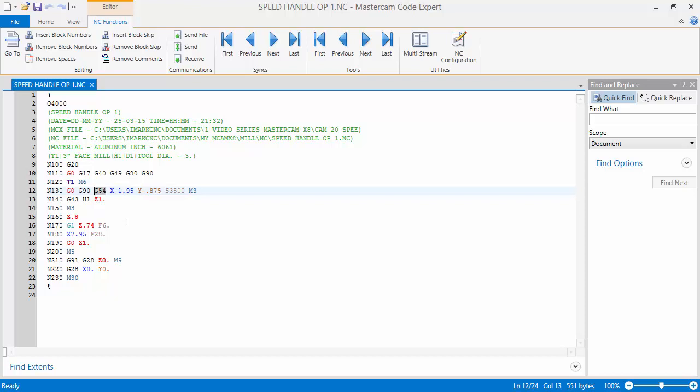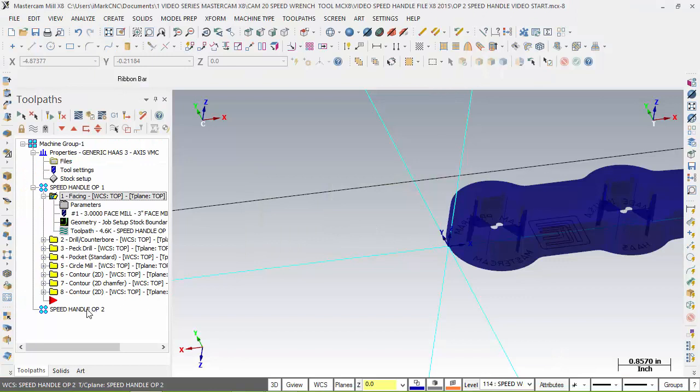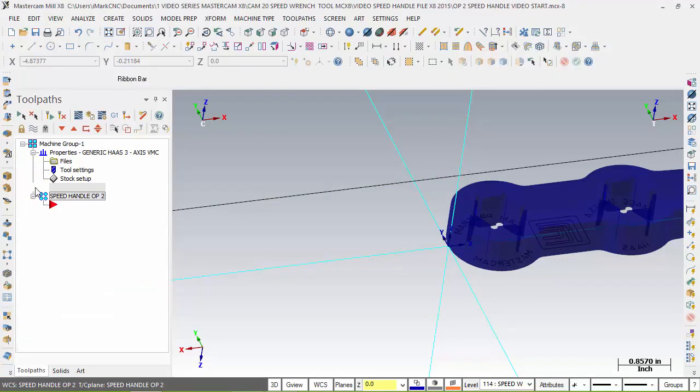Now everything after, in the new tool group called Work Offset 2, will be reading 55 for my other toolpaths on the flip side. And that would work out for our second operation. I'll shut this down. I'm not going to save that. Now let's start down here. Let's move the arrow down below here so we do all our toolpaths here. This I can shut down now because we already completed that.